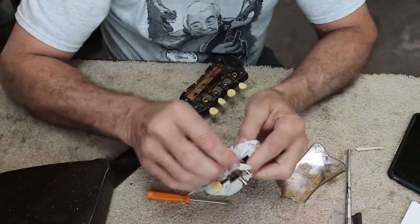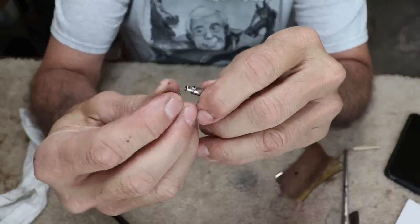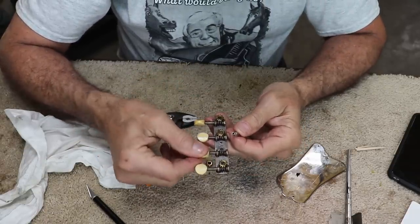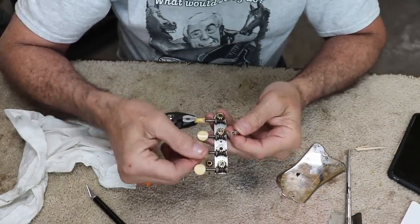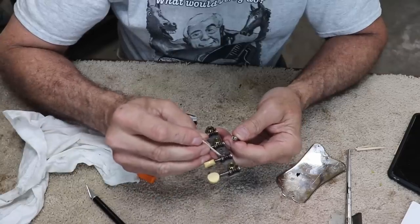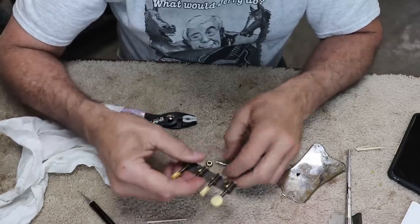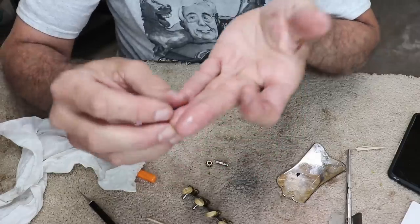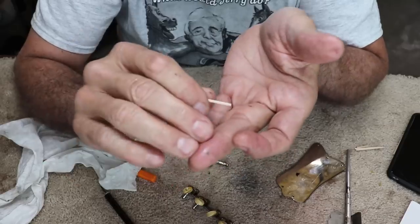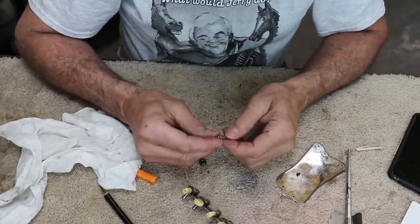I'm going to have to give this some thought, see what the problem is. I've taken this gear apart because I know there's something wrong. I don't know what it is exactly. It kind of looks like the worm is worn a little bit more in the middle than on the other ones. And I would say that's because this one turns so hard, and over the years people have just worn it out. Oh, look here, as I'm talking to you, I found a piece of metal that's worn off of something. I'm not exactly sure. It probably won't show up, but right on the end of my finger there, what looks like brass, and I would say that came off of this somewhere, probably sheared off because it's turning so hard.